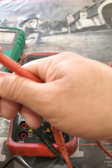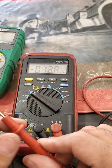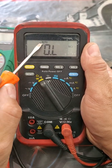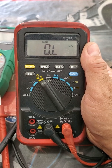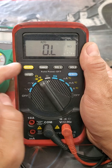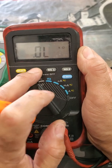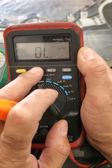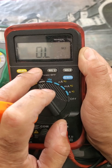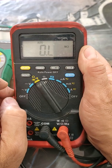For example, if I want to measure resistance, I'll go here. On this specific meter it shows 'auto,' which means it's in auto-range — as soon as it measures a certain amount of resistance it will self-scale. If I press 'range,' I can manually cycle through mega-ohms, ohms, kilo-ohms, and milli-ohms. I'll go back to auto.